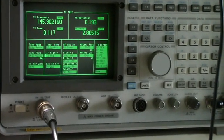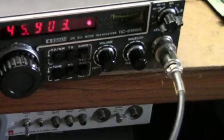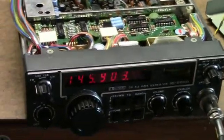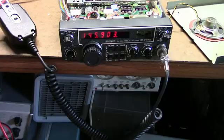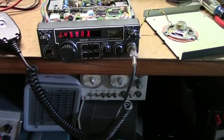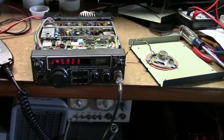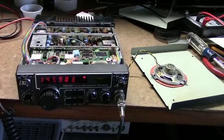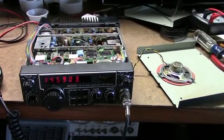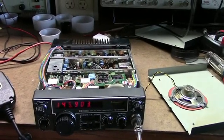The output is only about 100 milliwatts, so we've still got a problem with the transmitter. But the receiver's working good. I have an external speaker hooked up right now. Anyway, the receiver is actually pretty good. I see I have a light out in the meter — that can be fixed with an LED. The next step is to find out why we have low transmit output. It should be putting out 1 watt on low power and 10 watts on high.